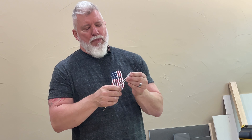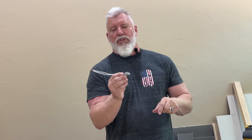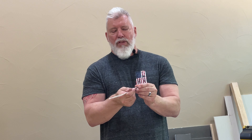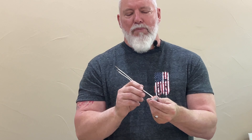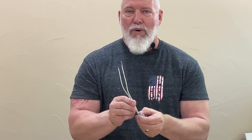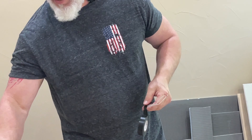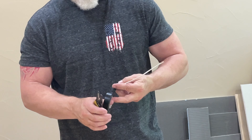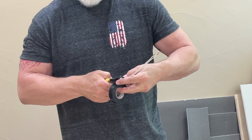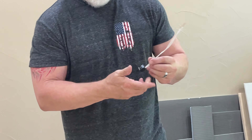Here's where you can run into a problem: you've got the wires in, they're nice and firm, and you go to put this inside the box. These little levers are actually facing backwards to keep you from pulling on them, but if you're not careful you can hit a lever just a little and open it enough for the wire to come out. What I'd suggest is to use a little electrical tape and wrap it around — you don't need a lot, just enough to hold the lever down. That way I can't pull that lever accidentally and it makes for a much safer situation.